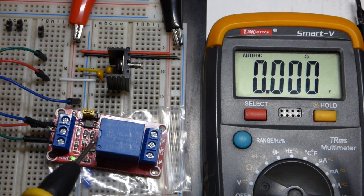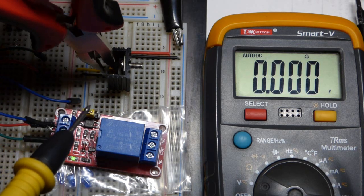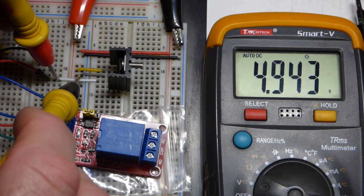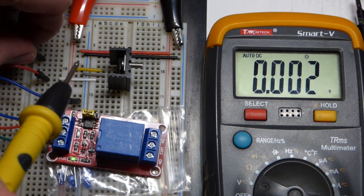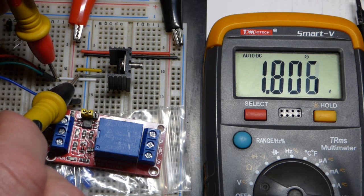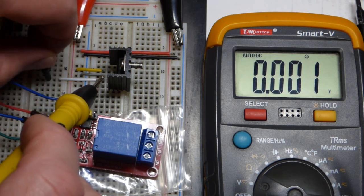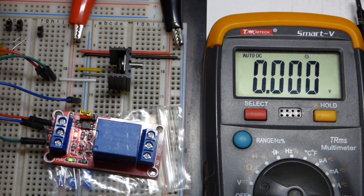Now I'm going to yank the capacitors and see how much worse it is. A lot of times I don't add the capacitors because it does still regulate voltage without them, but obviously not as well. First, with the relay not energized — you can see it's quite a bit lower. I think it was 4.996 volts before, but now it's dropped. When we energize the relay — it says it's only 1.82 volts. It really wasn't regulating. I'm surprised I was able to switch at all, but it did.